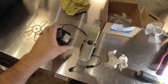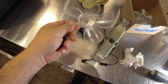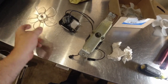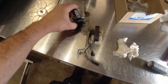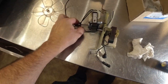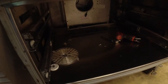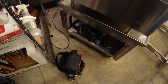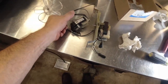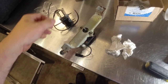As you've seen, the video camera decided to record in time-lapse mode. We went ahead and cleaned up the fan blade — it was pretty nasty looking. We're going to get this thing set up; the shaft is just a little bit longer on this one, but we can trim that down — not a big deal. We've already checked for leaks down here and over here, didn't find anything. It could be just because the evaporator fan's not running. We're replacing it — it's jammed up, just looks like crud.